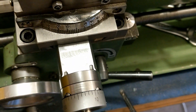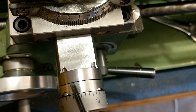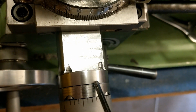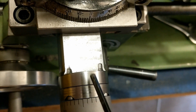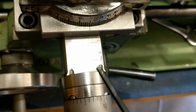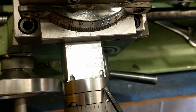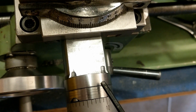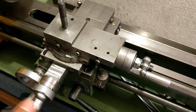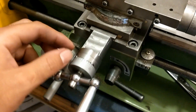That's why I made this bracket. As you can see, there is a very slight gap between the bracket and the cap, basically to preload the thrust bearing. The gap is very little — less than 0.2 millimeters — because if these two faces contacted each other, the inside of the thrust bearing could have a loose fit and play. With this setup I can preload my thrust bearing, and the gap is small enough that I shouldn't be worried about any debris or dust getting in there.